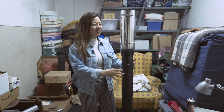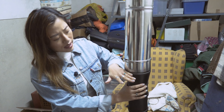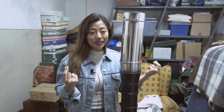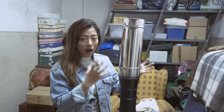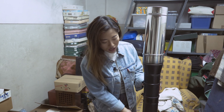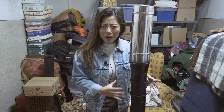This is the finished result and I think it looks absolutely beautiful — I'm really proud of it. I think it's way better than what the company did. Everything is really tight, perfectly insulated, nothing can fall out, and it's pretty solid. I'll explain why I left this part silver: it's the part that pops out of the roof. I did that to protect the roof and ceiling from burning and too much heat. The minimum insulation recommended is 13mm, and when I originally ordered it was all 13mm — that looked massive next to such a tiny stove. So I constructed this part with 10mm and 8mm underneath, and it's still nicely insulated with fair protection.